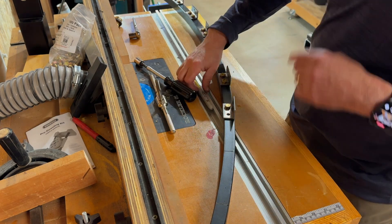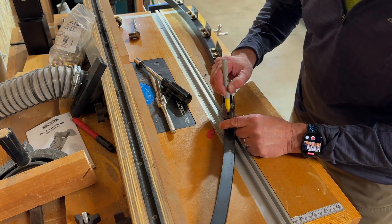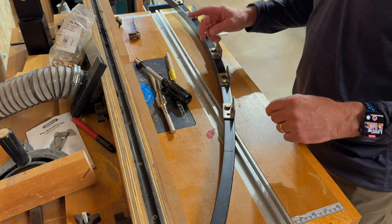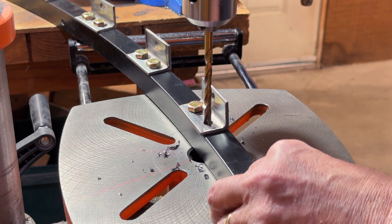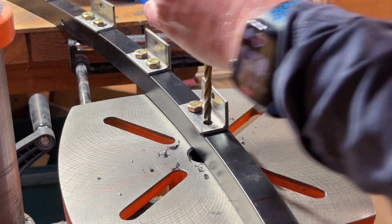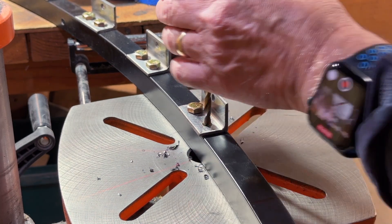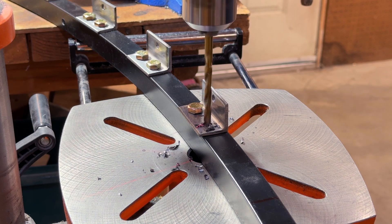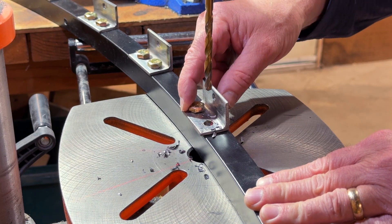Once it's in nice and tight and locked into position, I've lined the front face flush with the front face of the hoop. Then I mark the other hole just like the last one and take it over to the drill press. For the second hole it's more critical — I line up the bit, look on both sides to make sure it has equal spacing, rotate the bit 90 degrees to double-check centering, and then turn on the drill press to drill. The next step is to loosen up the bolt and tap the hole.